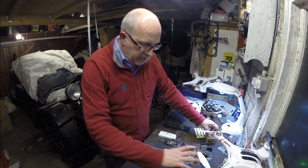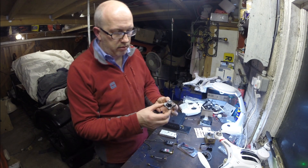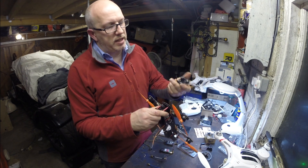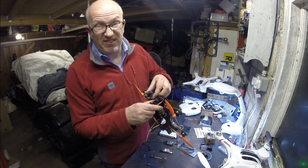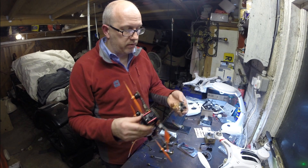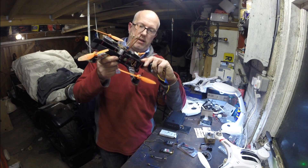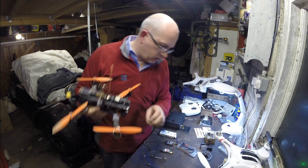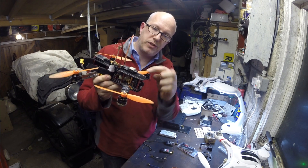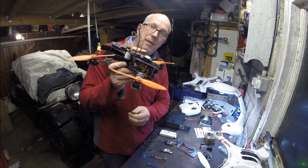Once you've got all these set up, you need a camera. Here's a whole series of cameras. The typical board camera you see on mini quads often has fixings on the front so it just clips in place — they're very good cameras with great light rejection and reasonably robust. The big problem is when you're flying these things, they don't fly level — they fly nose down going forward, so you want the camera angled the right direction. I generally end up getting these little encapsulated ones, which have a vibration proof mount with a little bit of rubber, and you can aim them up so that when you're flying along at a fair old lick you can actually see where you're going instead of just seeing the ground.